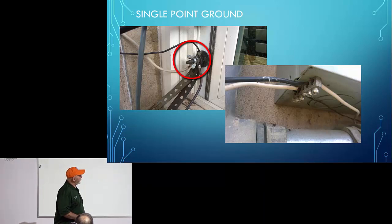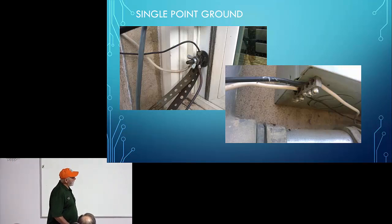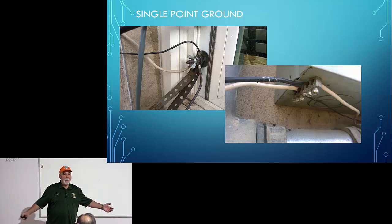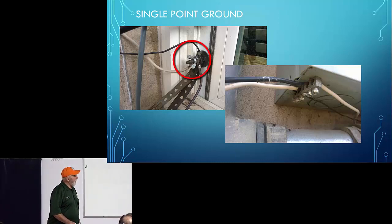And then that lug is connected to ground rods and to my service ground on my electrical panel. So here again, everything is bonded together. And this is a picture of the underside of my electrical panel, and I know it's really hard to see, but this white and black wire go to grounding rods that are connected to my tower. This is the white wire that comes from my shack. So here again, all of the grounds in my entire house all terminate there.